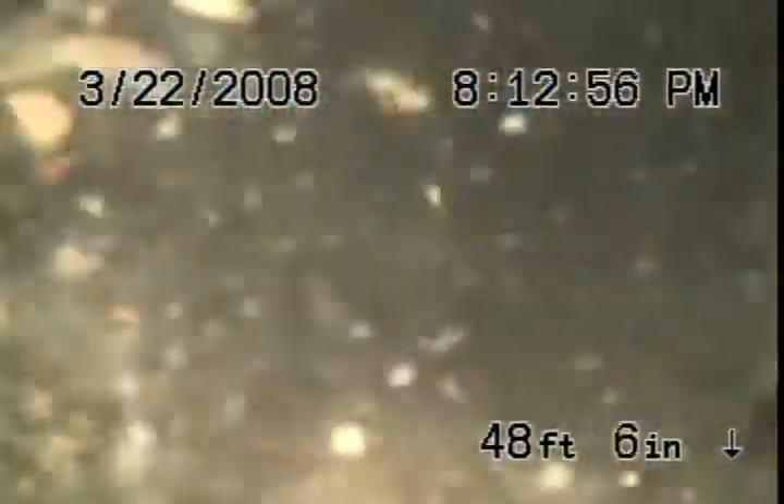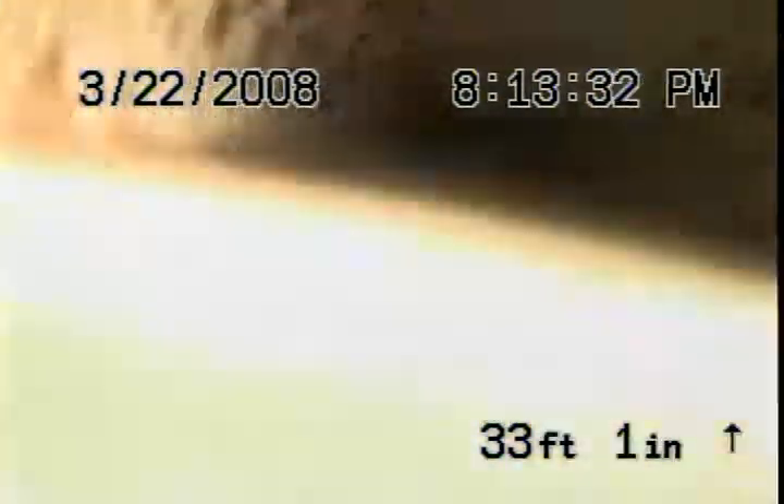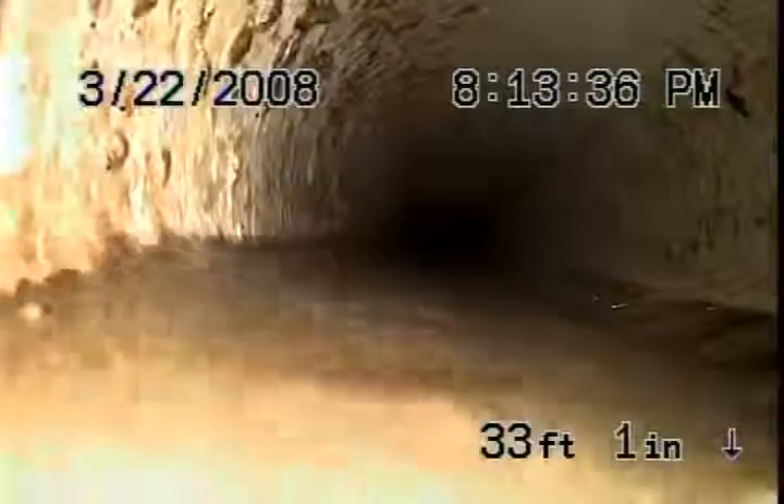You can see this stuff's just kind of flaking off, but it's still going to slow down the flow of paper and solids. In this part of the line we're just submerged — the camera head's submerged — so it's causing this line to hold water before turns and before drops. But you can see our snake went right through there. Now we're built up on a spot, probably before a fitting. That's where it builds up, makes it hold water. And now we're diving down out of the house.